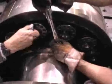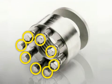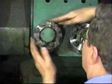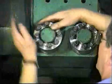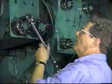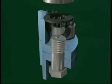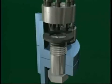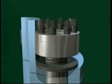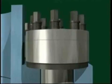Let's learn how they work. SuperBolt tensioners utilize a ring of hardened jack bolts threaded into a nut body. To install, the SuperBolt tensioner is first threaded by hand onto a new or existing bolt or stud. Once positioned, bolt tensioning is accomplished by tightening the circle of jack bolts. As can be seen in this animation, once the nut body is threaded onto the main bolt, the jack bolts thrust against a hardened washer and push the nut body away from the bolted surface.